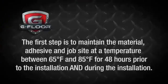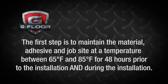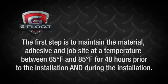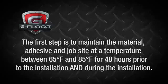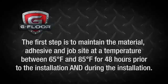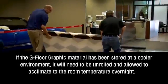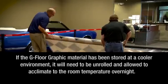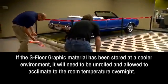The first step is to maintain the material, adhesive, and job site at a temperature between 65 degrees Fahrenheit and 85 degrees Fahrenheit for 48 hours prior to the installation and during the installation. If the G-Floor graphic material has been stored at a cooler environment, it will need to be unrolled and allowed to acclimate to the room temperature overnight.